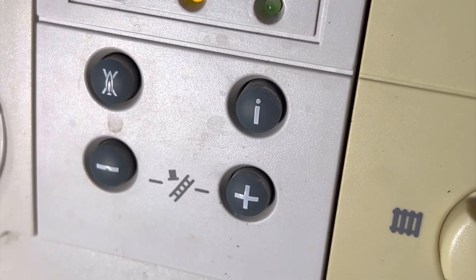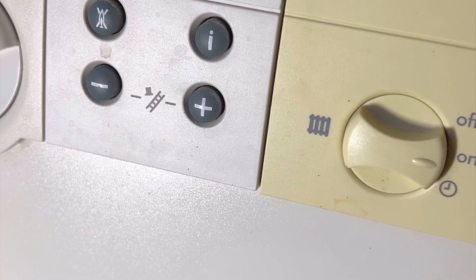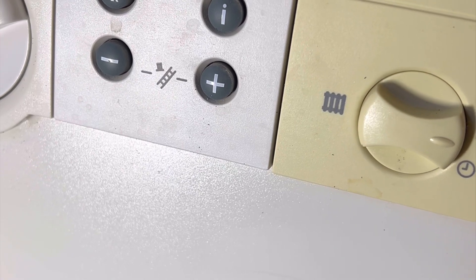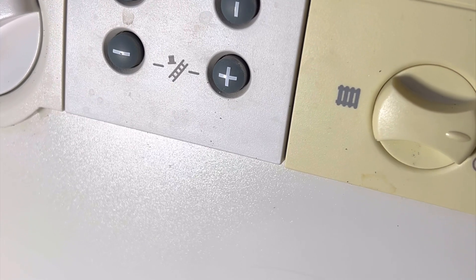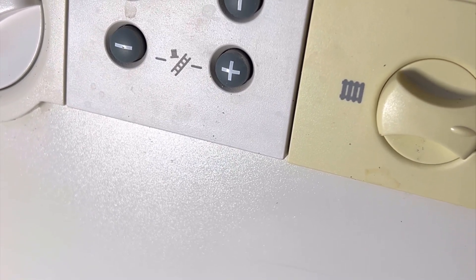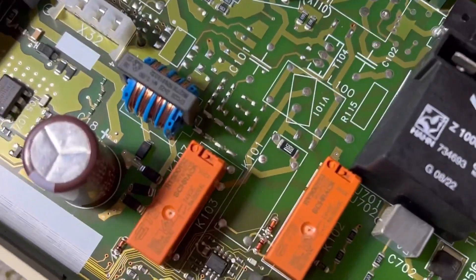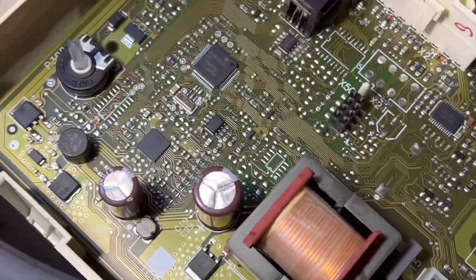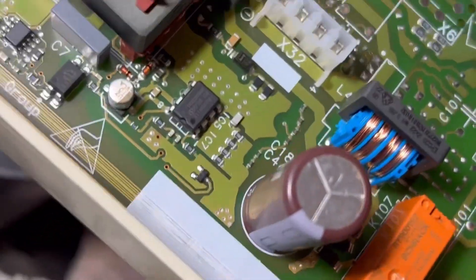As you can see, not really a lot is going on - the fan's just running the whole time. I've replaced the PCB. You saw the state of the electrodes - they were way too far gone so I replaced them as well. Next up is replacing a circuit board because it wasn't recognizing that the flame was lit and kept coming up with F61 even though the gas valve had been replaced, so I went along with that as well.